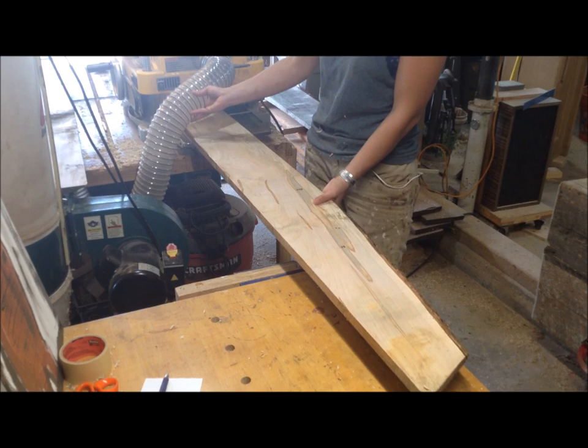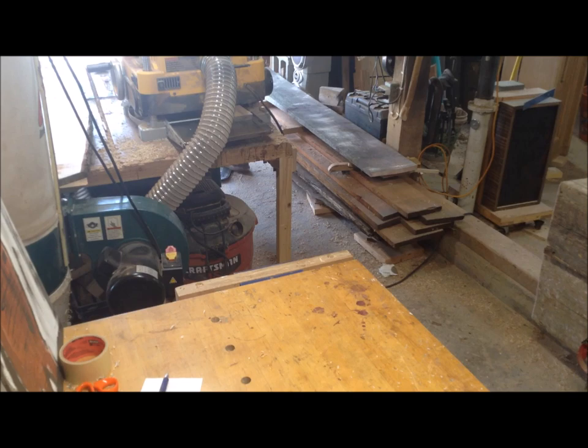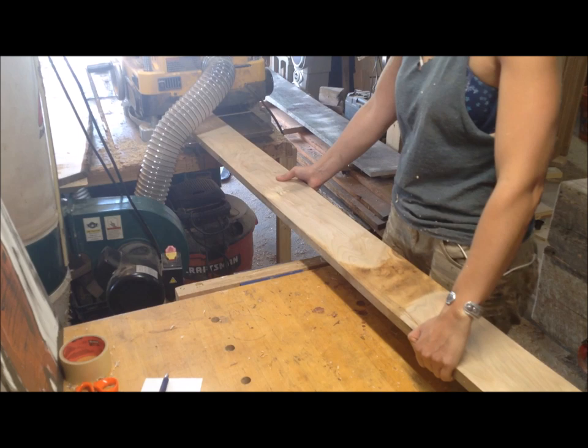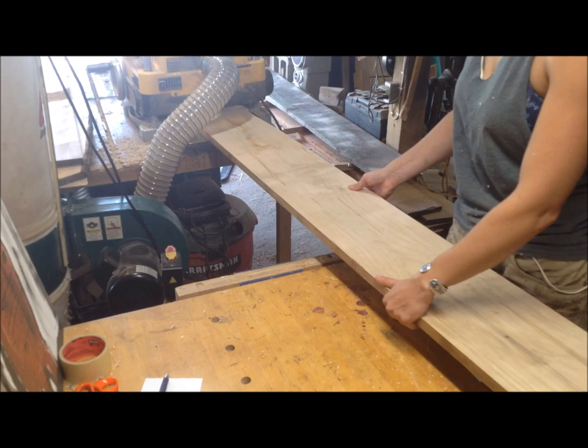These are usually not immediate effects of improperly dried lumber. Sometimes furniture will last a few months and be fine, but usually at the change of the seasons is when you'll start seeing problems. You also have to consider where you live. On the East Coast — I live right outside of Philly — there are huge moisture changes at the change of the seasons. Other people who live in climates that are fairly consistent throughout the year aren't going to have as much of an issue with wood changing.